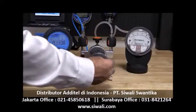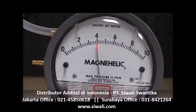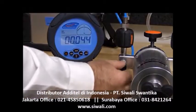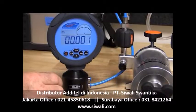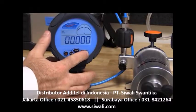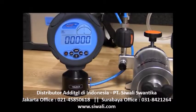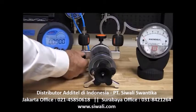For many analog gauges, it is good to exercise the gauge to its full scale one or more times prior to taking calibration points. First, we need to zero the reference. We could also zero the DUT if it allows for a zero. Because this is an analog gauge and is not normally zeroed in application, we will not zero the DUT for calibration.